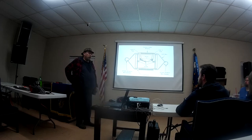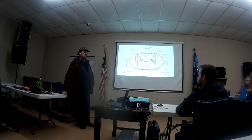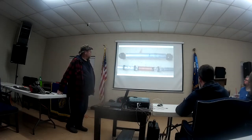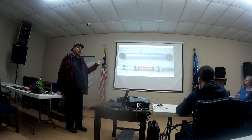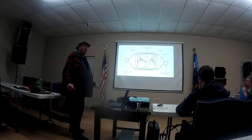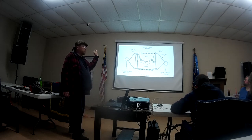There's a homebrew version of a trap that was built — I got that from you. This is a commercial version from a Hygain product. All this is is a tank circuit. The coax creates the coil, and the space between the center conductor and the outside makes the capacitance.